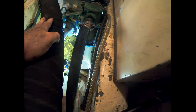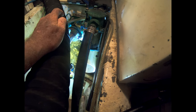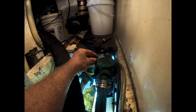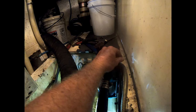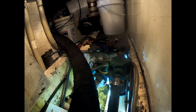Let's go back down here and see what we can do with this AC strainer. First thing, I want to shut my valve off right here. We'll do this while we're watching the shaft — I don't see any leaks out of the shaft anymore. It was just a continuous stream of water coming out of there, and now not even a drop. That's what we want to see. It seems like these should be wing nuts instead of bolts, but they're bolts and they weren't very tight.